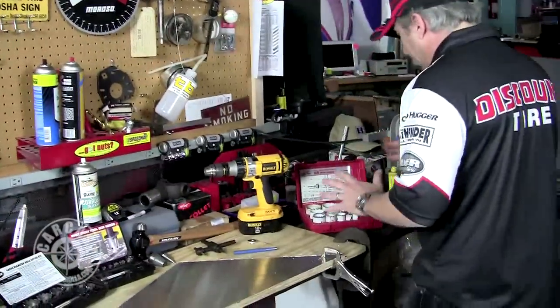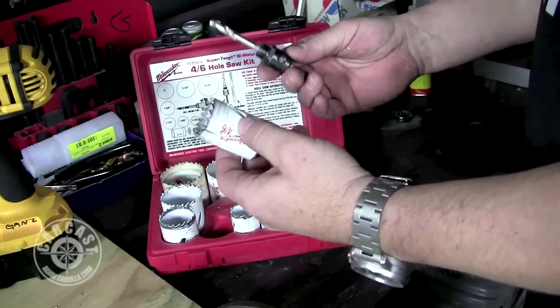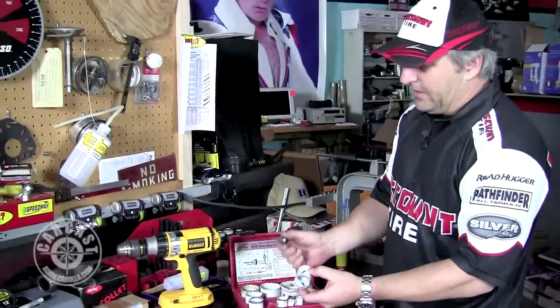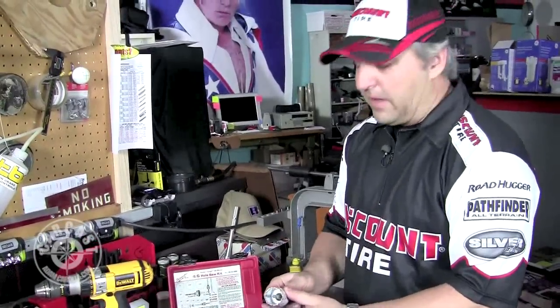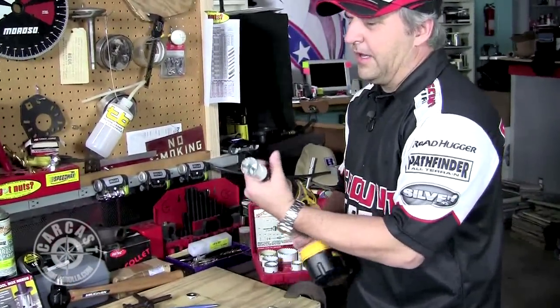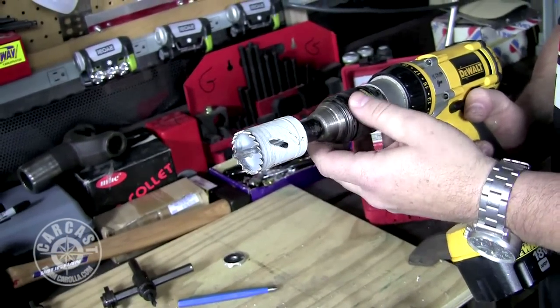Everybody has seen one of these — this is your standard Milwaukee hole saw kit, bi-metal blade. It'll drill through anything. You can buy replaceable components, small and large. If you don't have any of these in your toolbox, I'd be very surprised if you're doing any fabrication. They're usually not the cleanest thing. They have an arbor with a drill bit, and these are replaceable when you mess up the bit. For all intents, this is what many people use for drilling larger holes — you can get these things up to probably 10 inches. They have an average quality finish, and one problem is the hole can wobble as you're drilling. The surface finish is less than great — you usually clean it up with a file and it's fine.